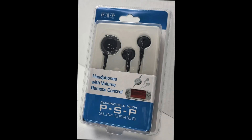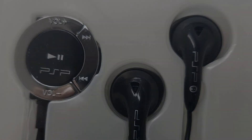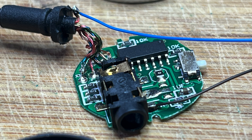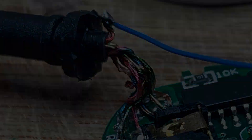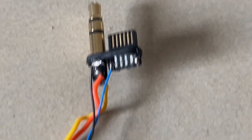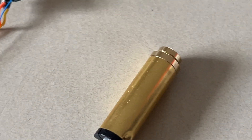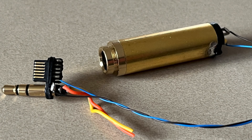I had the headset back in the day, but this time around I got a China clone of the PSP remote. It turned out to be really fortunate that the audio input is wired through the cable and just dangling loose inside. The blue wire you see here is where I managed to solder the end of the pigtail that was left dangling inside the remote. Maybe there was an option they were going to create a product with a microphone, maybe not. But it isn't enough to simply connect to the audio input without the remote — it just doesn't work. The PSP 3000 will just continue using its internal microphone and it wouldn't be easy to connect a guitar to that.